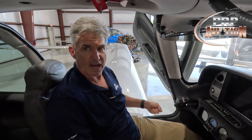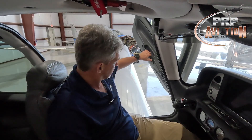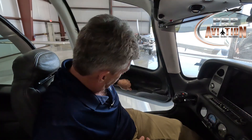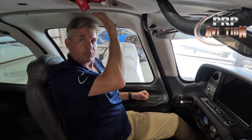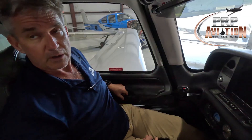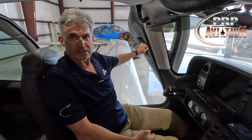There's no inside latch mechanism to help with final locking, so it's the momentum of the door itself that causes the latches to go into the locked position. When closing, use that curved hand motion with a nice positive closing. I put my elbow on the armrest and my shoulder on the door — just like with the Gen 6 — and push. There's no movement, meaning it's secure. To open, lift the black handle, you'll hear the click of the latches, and the door swings open.